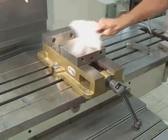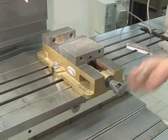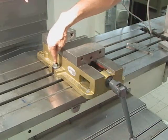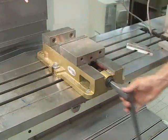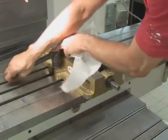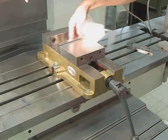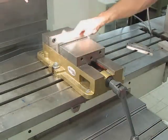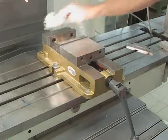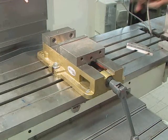You're probably all familiar with the vise. This particular vise has a handle that opens and closes it. It is held into the table with T-nuts, using T-nuts with threads coming out of them, and the screws are tightened with the same handle as you would tighten the vise with. Chips often get inside a vise, so if you want accuracy, it is very important to make sure the inside of the vise is extremely clean. We have an air gun mounted onto the side of this machine — it blasts compressed air.